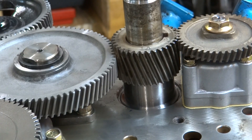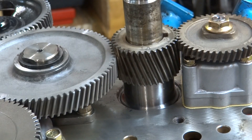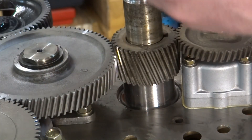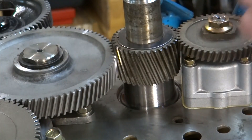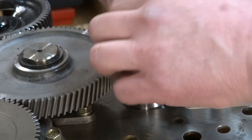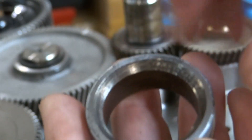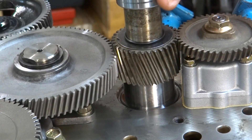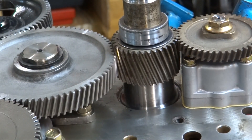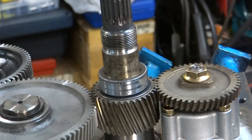Now what goes on here is what the book calls an oil slinger, an o-ring, and then a collar. When I took this off I noted which side was the outside. I'm putting the collar so that the notch is uncovering the timing mark. I'll put the o-ring in place, then the collar with its generous chamfer facing down, and finally there's a keyway here that takes this key.